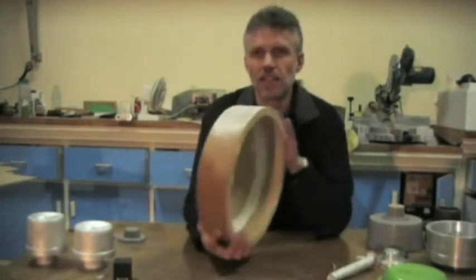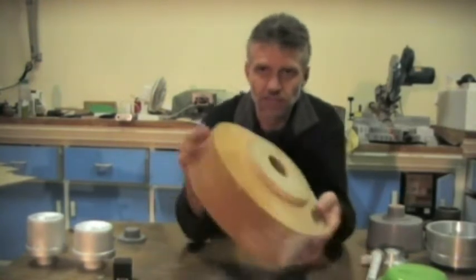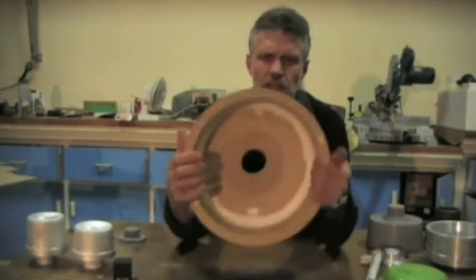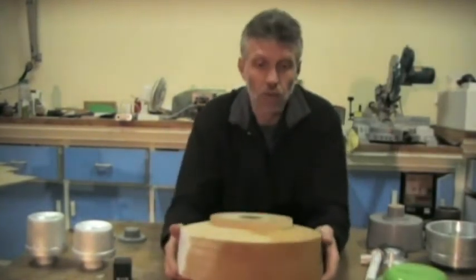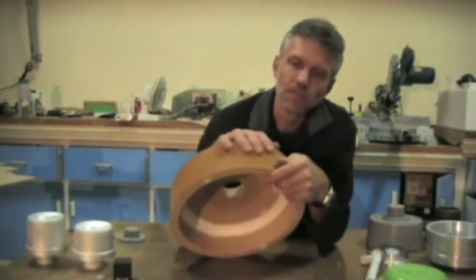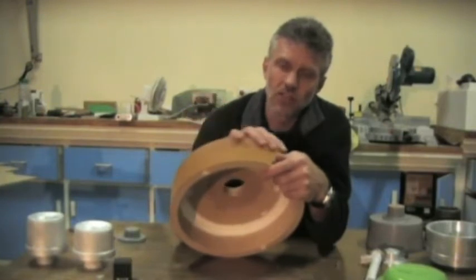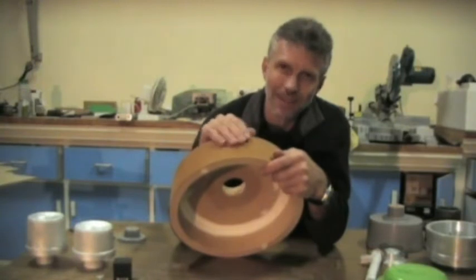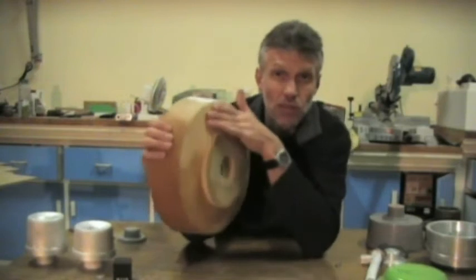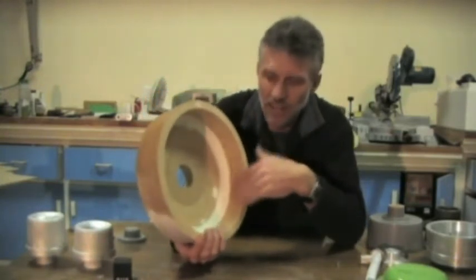It also cleans up really nicely. When you machine it, it fluffs. And as we can see here, this is a very rough surface — very rough. We need to make that nice and smooth. The way I like to do that is after it's finished, I'll give it one coat of shellac. It's a varnish made from beetles; you water it down with methylated spirits, and if you do it quite thin it'll soak in and make all the fluffy bits hard. Once that's dried, then you can sand it. And that's what this bit here is — that's reasonably smooth now. If you just get the sandpaper on the raw surface, you're not going to get it smooth or get a nice shiny surface like you need.